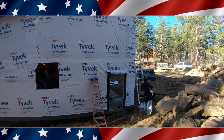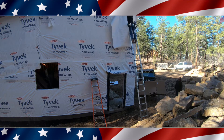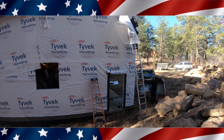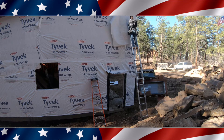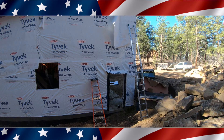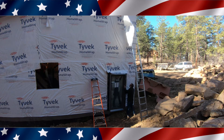We're getting this door installed while also finishing up the wrapping. Right here it's pretty high up — that corner is about 18 feet — and we end up using scaffolding, the tool cat, and an extension ladder. I should be holding that ladder with him up that high. We're going to work our way around this building sealing it up with the house wrap and installing the windows and doors.